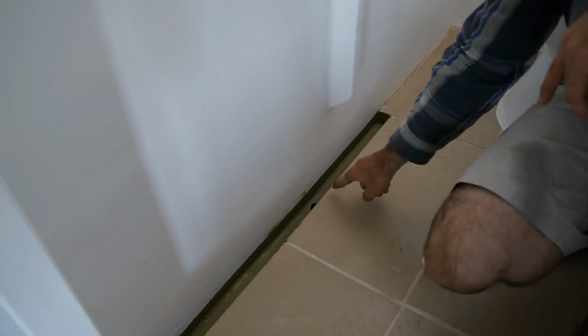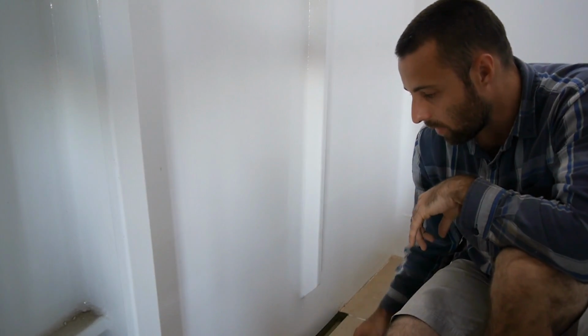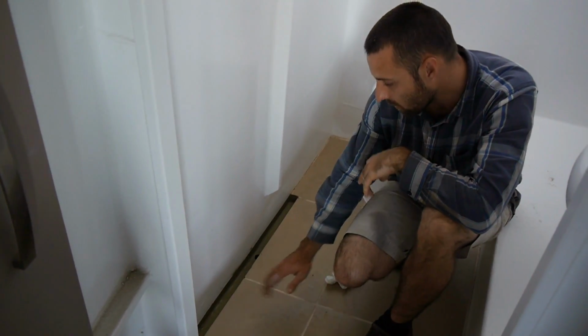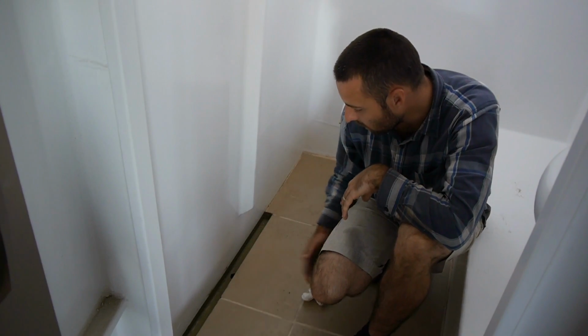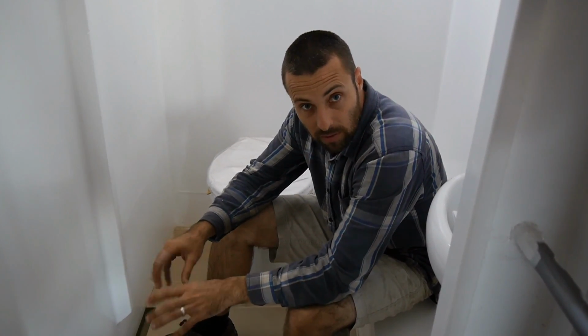Once it's down there, it'll run down these two stainless pipes that are welded in, and our plumbing connects to those. When we're finished with Brupeg, this won't be visible. We'll have a nice stainless grate over there, so it'll all look flush and look lovely. But that's essentially how we've created our drains in the bathroom area. So that's how our drainage system works in the bathroom. Let me show you what the pipework looks like underneath these two drains.